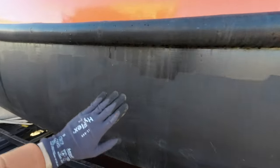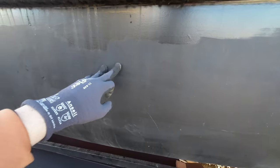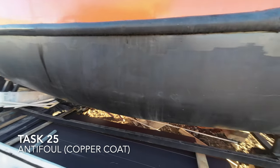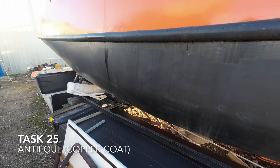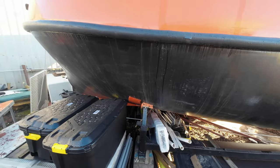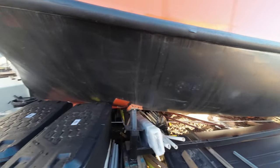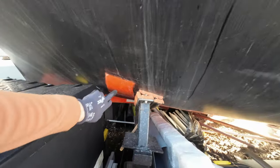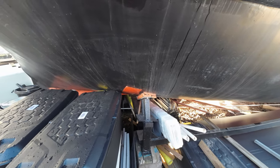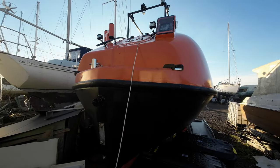The actual hull itself is going to be a big job on the list. This is simply epoxy primer at the moment — it needs to be done properly. I'm probably going to Coppercoat — I've got a quote from Coppercoat. As you know, Coppercoat is outrageously expensive, but for Alan's sort of use I think it's going to be the most cost-effective long-term solution to anti-fouling, and also environmentally the least unpleasant. There are still some areas which haven't been primed — that's where the cradle rests used to be and I just haven't got around to patching them up until I'm ready to do the main job.